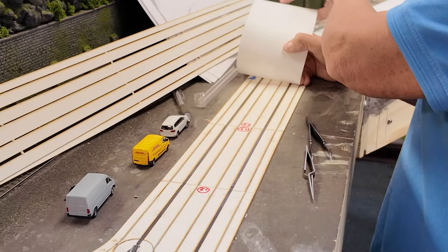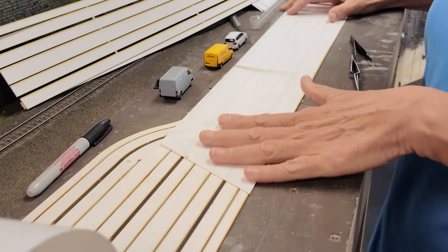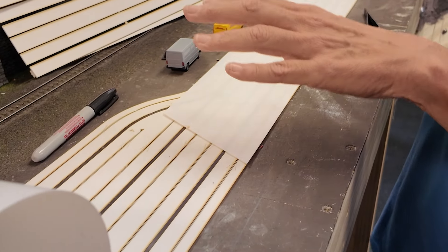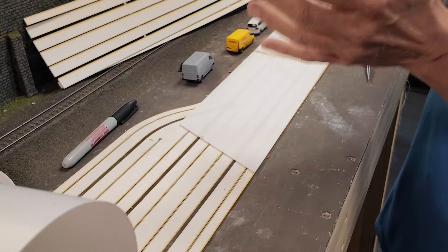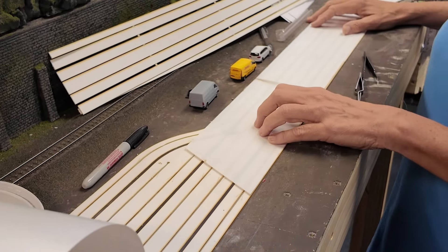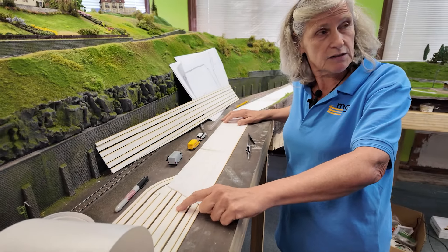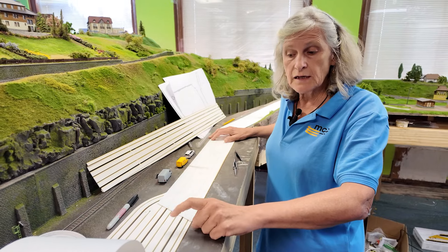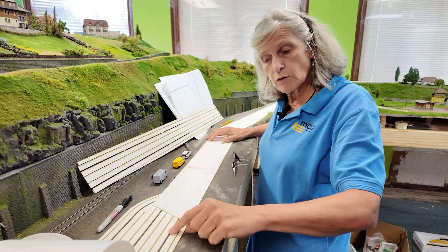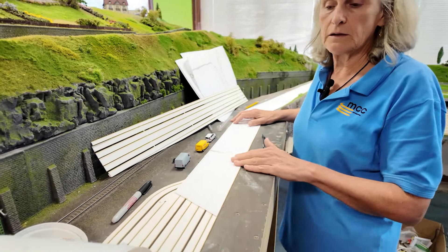You can use any kind of road material. This is normally plastic. You can give it a color — gray or red — depending on what you want, and you can put the stripes on it. You can use every kind of street material because our wire can go as deep as three centimeters, and our magnetic band only needs to be two millimeters thick. So the road surface must not be thicker than two millimeters.